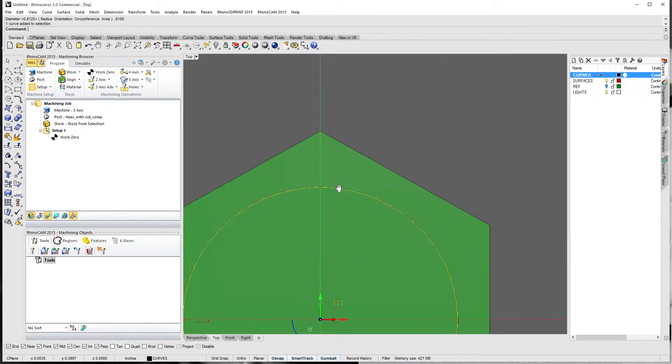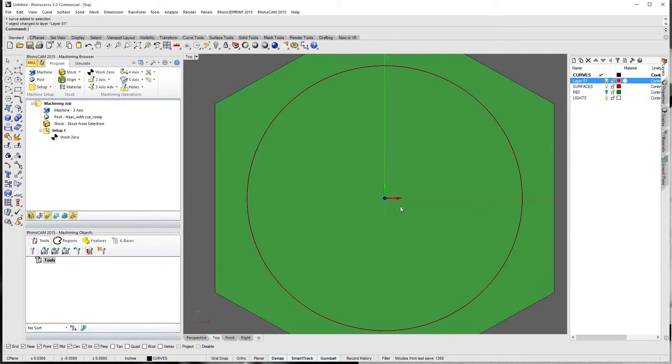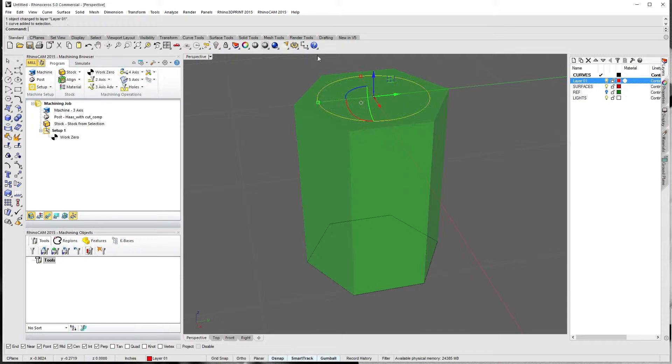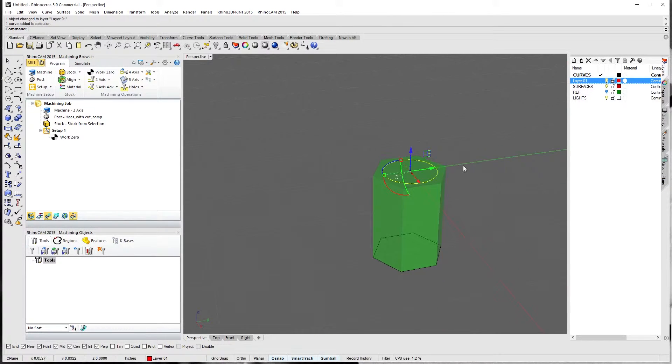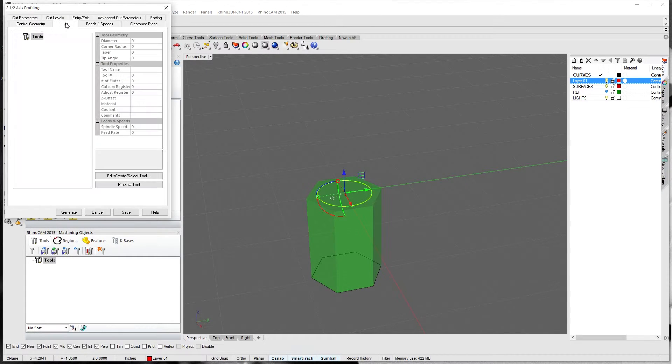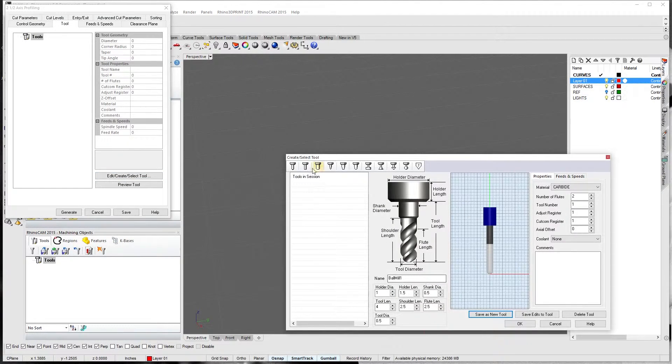What we're going to do is mill that down past that as well. This is exactly 0.8125 and that's saying max is 0.8108. So I'm going to go ahead and create another circle and make it 0.8108. You can see it's a very minute difference. I'm going to select it first, put it on a second layer, and give it a different color — red — just so I can see it. That way I can right-click, select object, and I've got it. With that selected, we're going to machine this down — just profile it a little bit so we can get down to size.